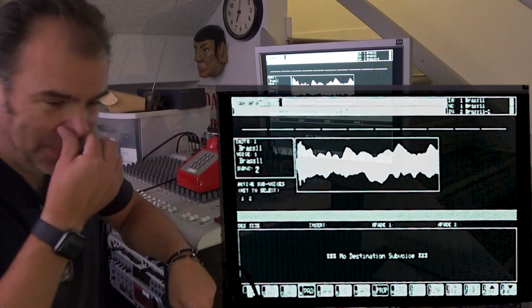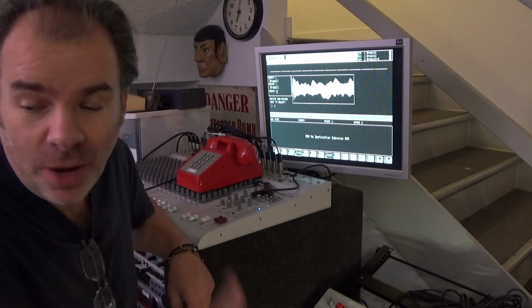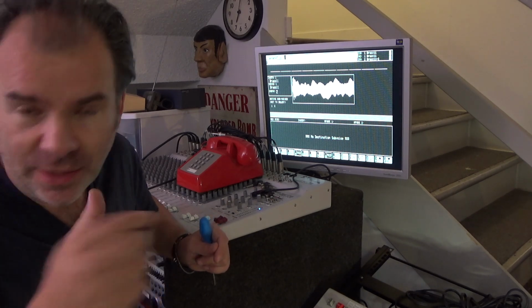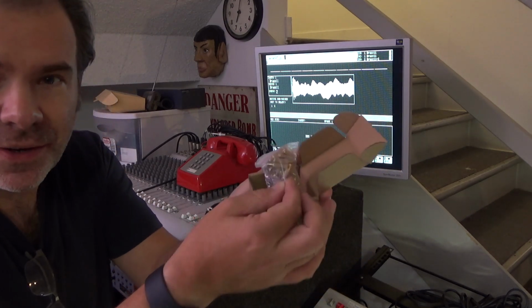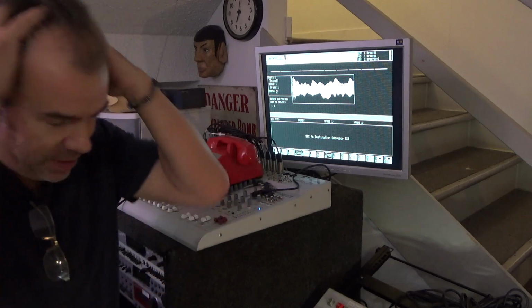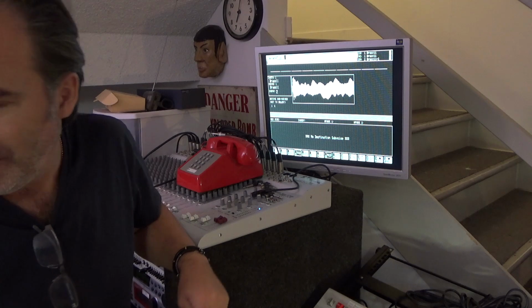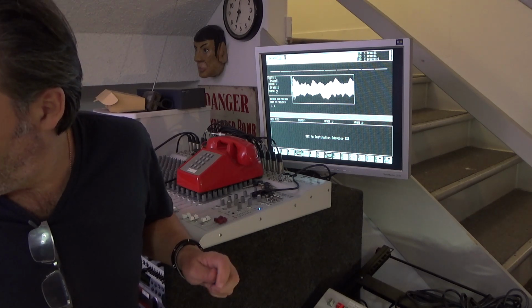So now what we've got is the SCSI to SD. I've got to re-emulate that on my SCSI to SD, not using Steve's. I've got to get a front plate that can hold the little on-off switches, and then I've also got these little posts here to hold the SCSI to SD card. So I've got to get that plate made, and then on top of that, I've got to get hinges and figure out how to get all the metalwork so that it actually closes. That's going to be an interesting one. I've got to make the 19-inch rack ears so it can actually be mounted somewhere.